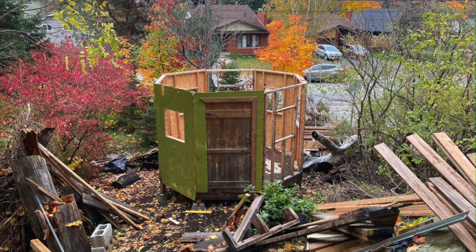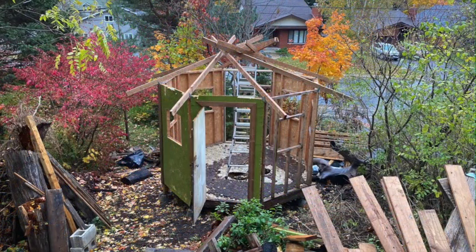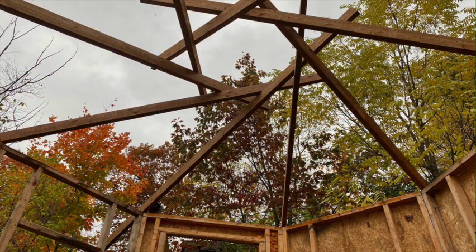Basically, you start with one beam that runs from the middle of the roof out to the side, and you support that with just a post or something. Then you lay the beams down one on top of the next until you get to the last beam, which actually rests on the first beam. It's kind of hard to wrap your head around it, but the structure is self-supporting.